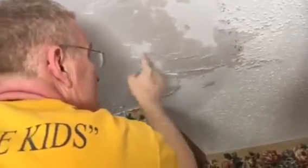Now you can see right from your own eyes where I need to fill it in. I'm good here. All I got to do is smooth this out with another thin ready mix. No more hot mud over here. Check this out over here. You see that? I had my flat straight edge from here to here and across this, which means this needs to get filled in right here. We're low here. So that's the idea.